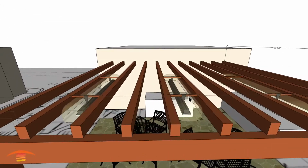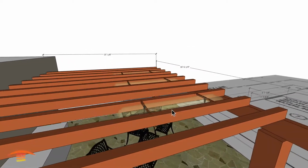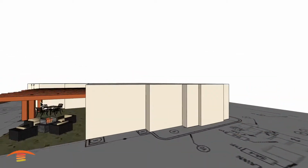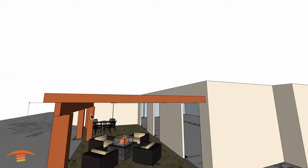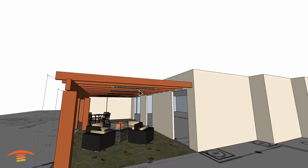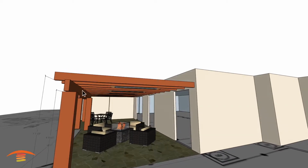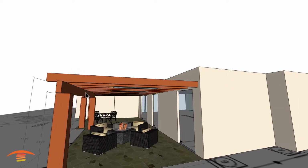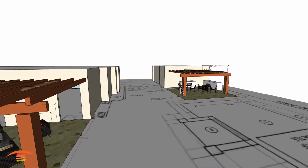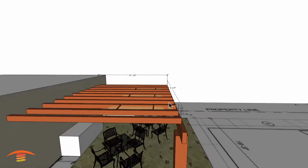And I've already done that on these other units here. So I've got 3 4,000 watt units over here. I didn't mention this before, but the customer did have those existing 3,000 watt units here, and what I'm recommending is 4,000 watts. If they wanted to take those old units and convert them to a 4,000, you just buy a new bulb for that. Now you can't do that with every application. Your wiring has to be rated for a 4,000 watt unit. You don't just increase a bulb because you want more heat. You've got to make sure of your wiring, otherwise you're going to have a fire hazard of that magnitude. So in any case, these are all 4,000 watt units that I'm recommending.